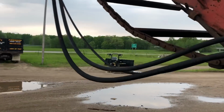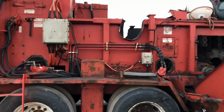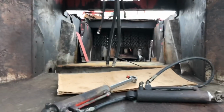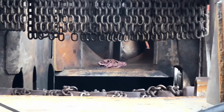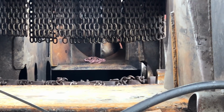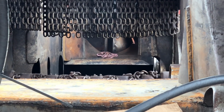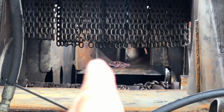Better. We'll look at it from the back. What we're trying to do is make that wood just roll right through this thing with no hiccups. You know what I mean? Nothing in the way. That's what we're trying to do. So that's what we did. As you can tell from back here, she's a lot smoother transition over here for that wood to go in. Before, there was a big, it was not an easy transition for wood. If it would have gone in at an angle like this, it stops, and now it's going to hit that and just slide on in.